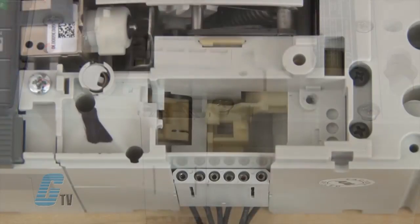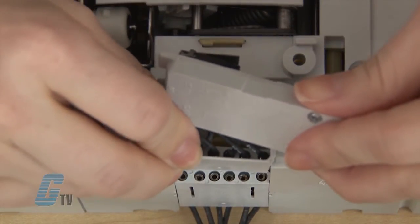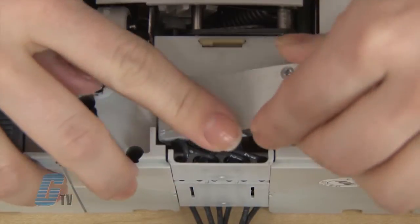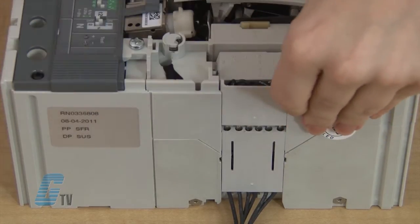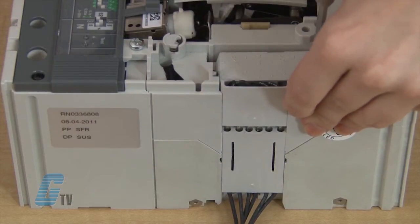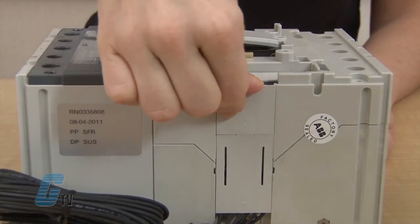For the T4 and T5 models, there is a small tab on the bottom of the contact port and I will need to place the contact on an angle. The tab should fit into the indentation on the bottom of the auxiliary contact. Once the contact is in place, I will use a screwdriver to secure it, then place the pins into the connector.